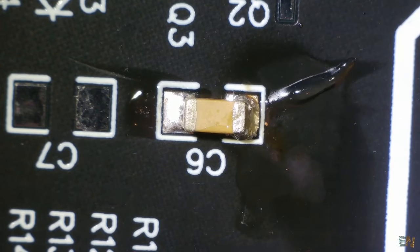The same process applies to an SOT23 MOSFET: solder one pin, slide the component in line with all the pads, let the pin cool, and solder the other two pins. Note that it takes more time to heat up the pad connected to the ground plane, because it's connected to more copper which dissipates more heat. If not given enough time, it will create a ball of solder on the component.